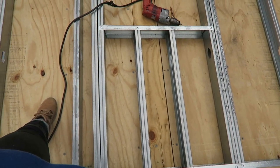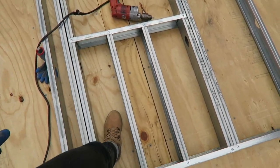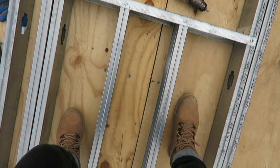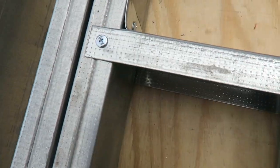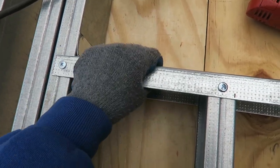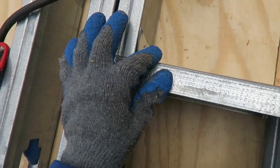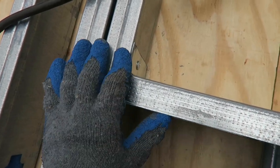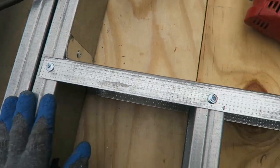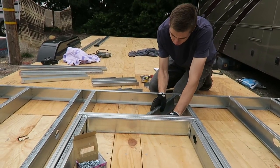Done with the footer, and this is what we did. Just put two, what are these called? They're not king studs, still studs, just not king studs because they don't go all the way up. But this is the footer right there, so we put those in. And how we're putting in all the pieces that go horizontal inside the walls, which are track, is we're cutting. You snip here, you snip on the other side, and then you bend this up. I will show you guys probably in the next video exactly how we do it. And then it can just slide in. You can screw here, and on the other side. And now we're just working on the header over there. Once that's done, the whole wall will be complete.